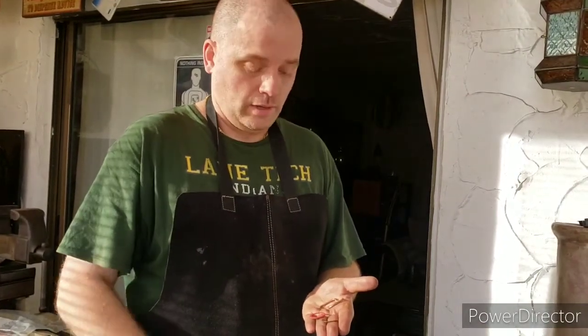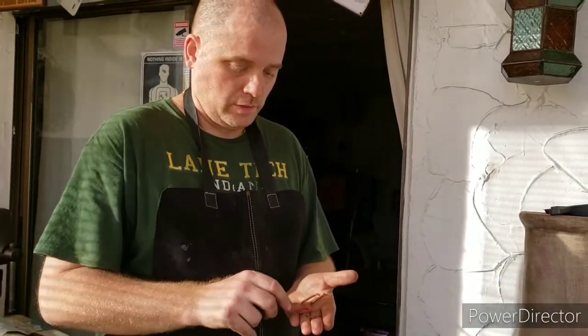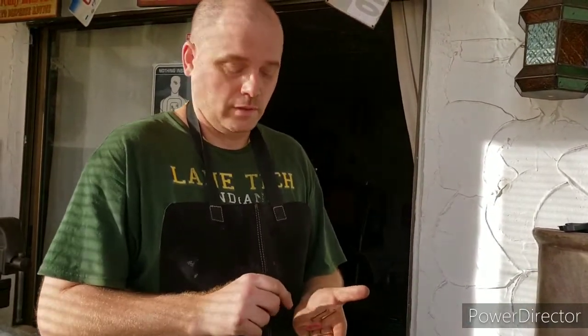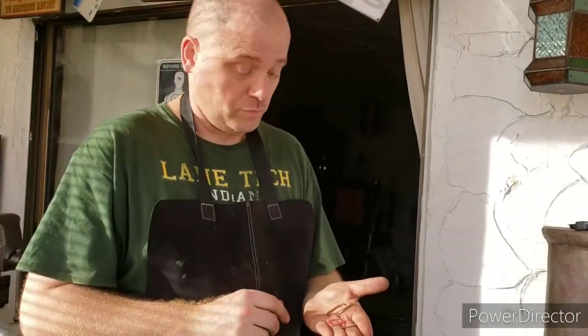Okay, so I'm getting ready to start putting the motor back together, at least the big components of it. And in order to do that, I had to replace one of these fiber washers, which was broken. I have an assortment of those. If you're going to be serious about these electric motors, it's good to have an assortment kit of the fiber washers, because you need these things all the time to get the shaft spaced appropriately.